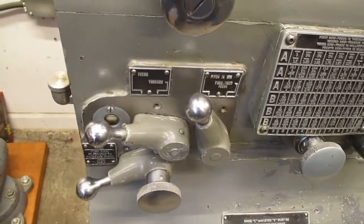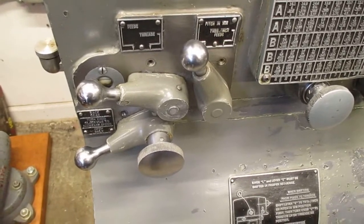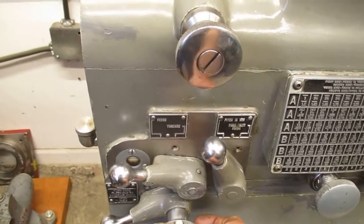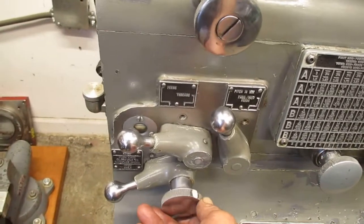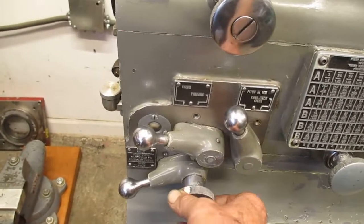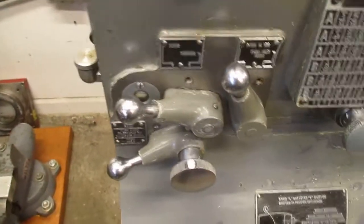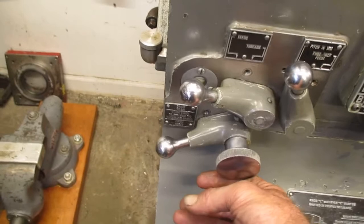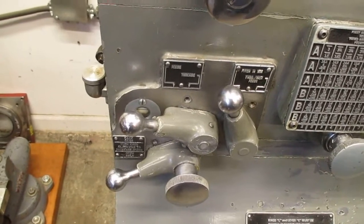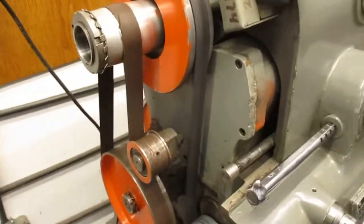And it's less shock on the machine. I mentioned in another short video about stick slip on the cross slide. So you want things to transition smoothly, starting and stopping. Okay, and I really think that's a good safety feature, to at least put the dot somewhere, so you can look at it and say, yeah, that thing's not all the way over and something's going to fly out of the chuck. Because if this knob is all the way over and you start the machine, it'll take two seconds, one-and-two, and that spindle's right at 4,000. Yeah, that's fast.